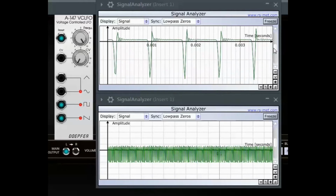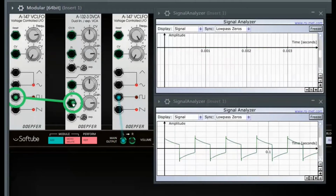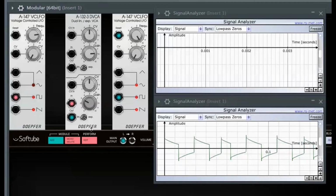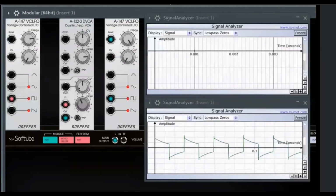Starting to think about these results, I first understand that there was a mistake in my thought that nothing would happen because of the same frequencies and the same phase. And this mistake reads: the reset process needs a certain level to act. Yes, phase and frequency of resetting and resetted wave are identical, of course, but the beginning of a cycle is not identical with the moment when the wave is resetted if the level of the wave at the beginning of its cycle is not sufficient to reset the wave. But, with square and saw, the level definitely is high enough to reset.